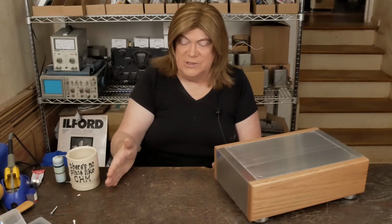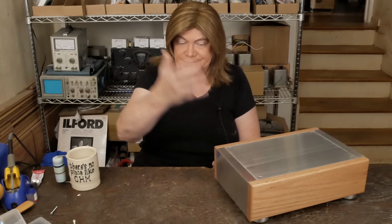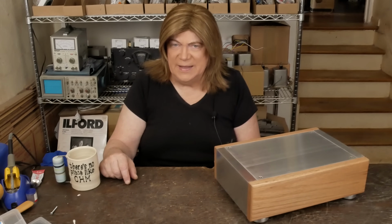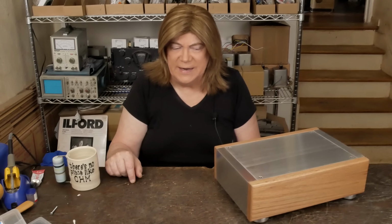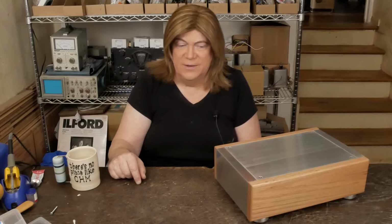And you're going to have a resistor from the grid to the ground on the amplifier anyway, so it should have zero impact on the sound once you turn it all the way up. And I found these Audio Note volume pots to be very transparent anyway. I know that's a whole other debate, and if somebody didn't want that, you could just jumper it out of the system and hook the RCA jack straight up to the input, and just put a little indicator light in the hole or something.